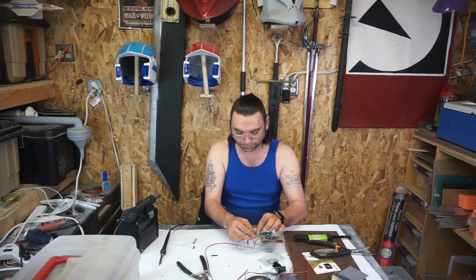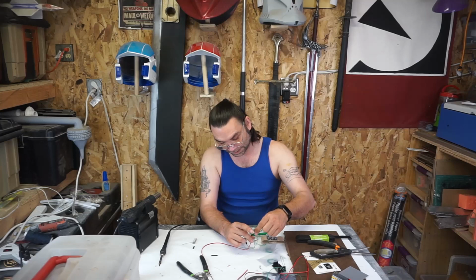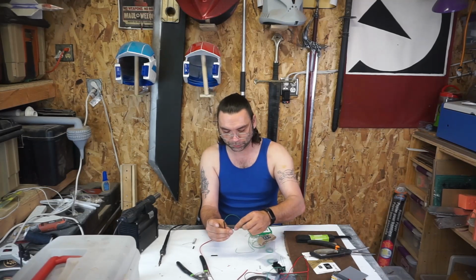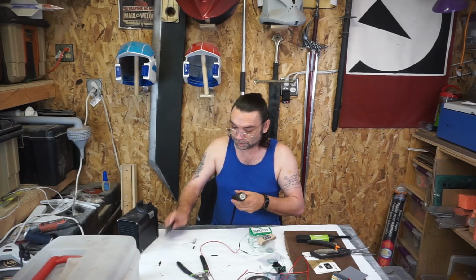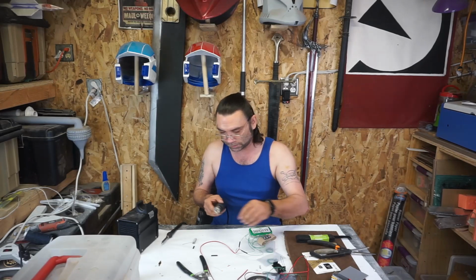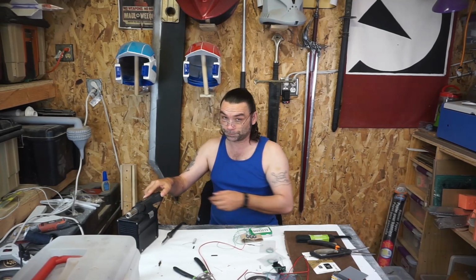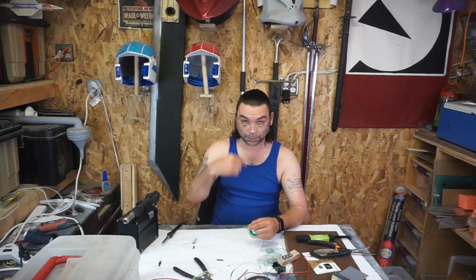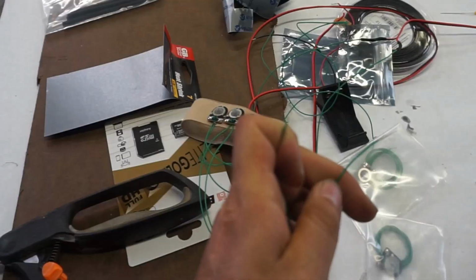Doesn't take a lot. I tend to fold one side up, that's very warm still. Put the heat shrink over, fold the other side in the opposite direction, put the heat shrink over, and then just heat it. A lot of people use lighters. Lighters drive me crazy. So the smart thing to do, not catch your table on fire, is to have soldered everything first and then heat shrunk. So the next one, I'm going to solder both ends up, both leads up, heat shrink everything. So I'll bring you in so you can have my view with this process.